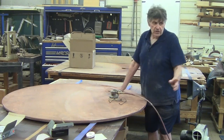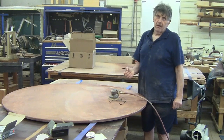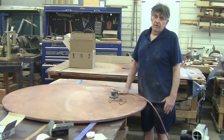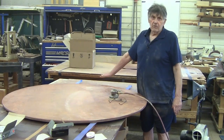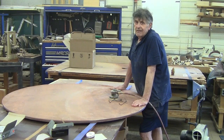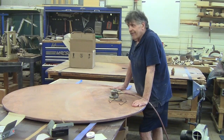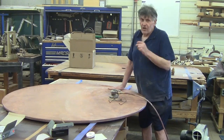In particular, like this curly cherry, we saw some, but on this tiger maple, the curl in it is so much softer. So, man, it's just sucking up the sanding sealer. Not to say you can't get on there with a Rhino pad and sand it out, but with the random orbit, again, it's going to make it just as slick and flat, and the sanding sealer is filling in the curl. Yes, and I'm using 320, you have to be very careful not to sand through. However, it's almost inevitable, a little bit. But that's also the reason we glaze.